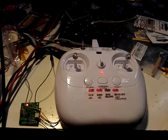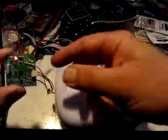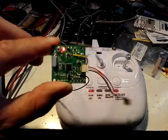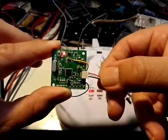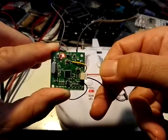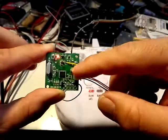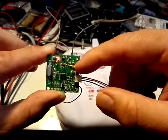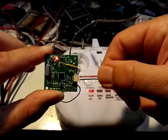In these cases you can remove the board, or at least remove its path from the flight controller, and just plug in power separately. All you need is 5 volts — this cable is correctly wired with ground on one end and red as the 5 volts. Don't worry about the white, that's just a signal I've been using for testing. On this particular board I've wired straight into the 3.3 volt line because I've damaged the 3 volt regulator and can't run off 5 volts at the moment.